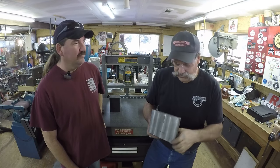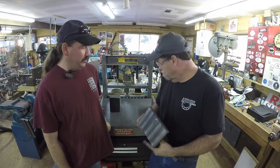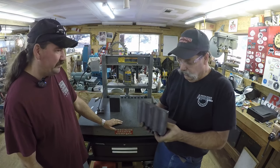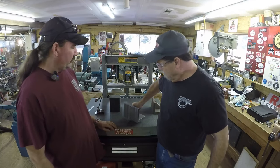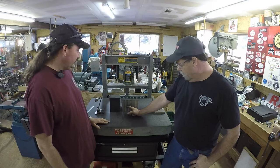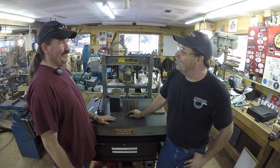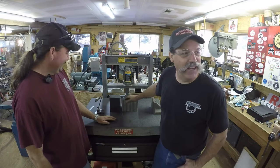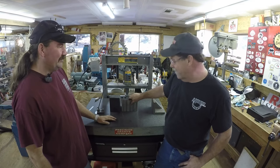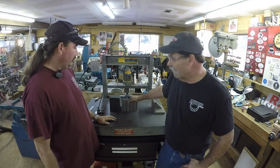The pattern was three-quarters of an inch but it shrank a little bit minimally - you don't lose much on these. All the castings came out really good. This is the only one that ended up with a couple holidays in it. We've milled these two sides and checked them on the plate - we're about seven tenths out of square in the five inches. We're really happy, we couldn't believe we got them that square just by milling it. They're fairly flat too - we run across a few tenths difference but not too bad.